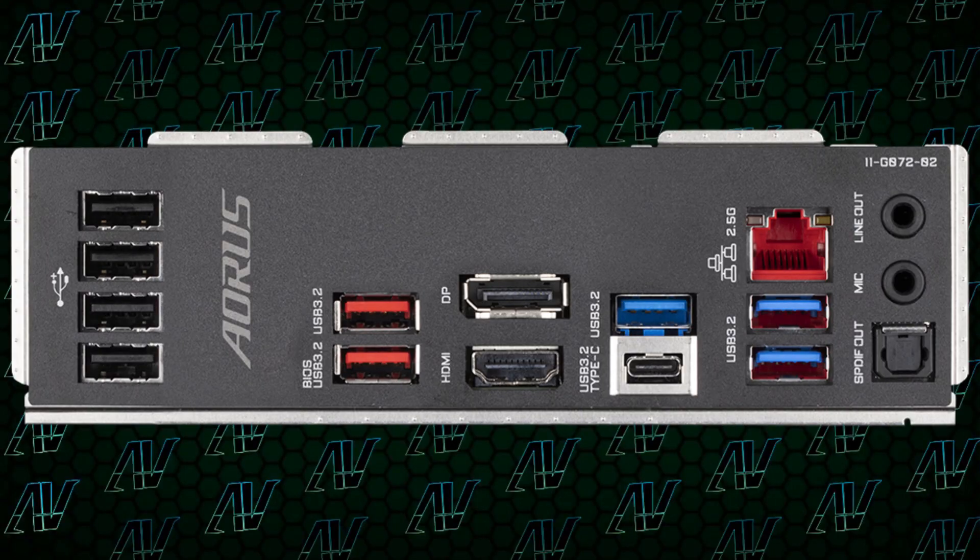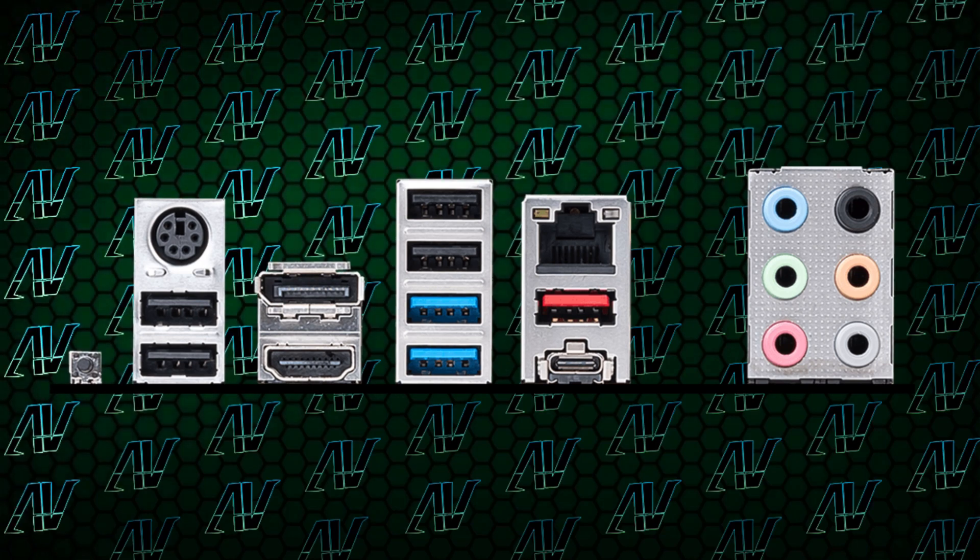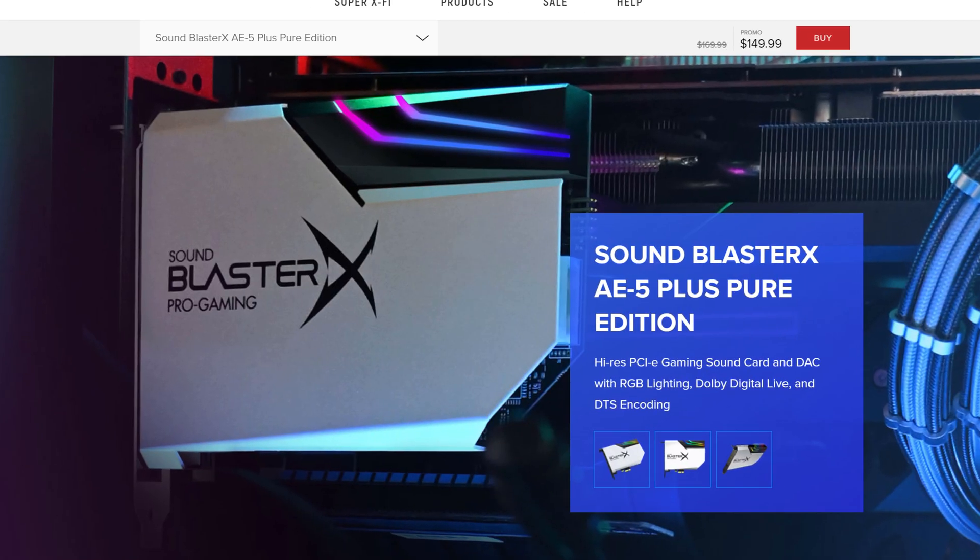Let's talk about something way more important to more people — the rear I/O. MSI do a great job here. Unlike Aorus, MSI did remember that six audio jacks has kind of been the standard for almost a decade, if not longer, so it's great to see them returning here. A lack of any optical audio support is kind of weird, though unlike some other boards — Aorus — there is a nice PCIe 1x slot here for a sound card so you can get that optical audio back if needed. With all these weird decisions regarding audio on motherboards, it really seems like sound cards are making a return. Definitely subscribe because we're going to have a whole video about that topic very soon.